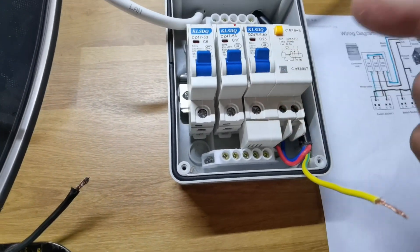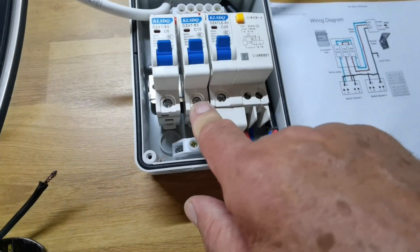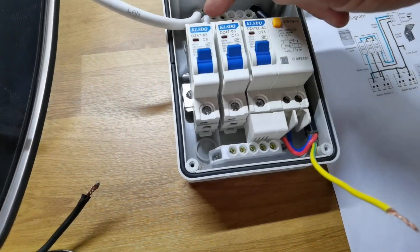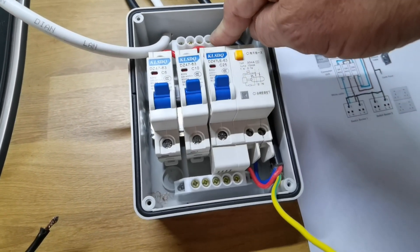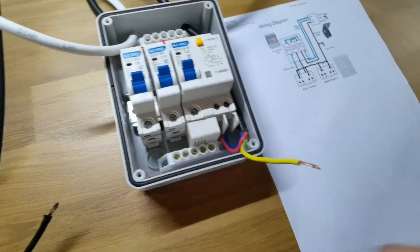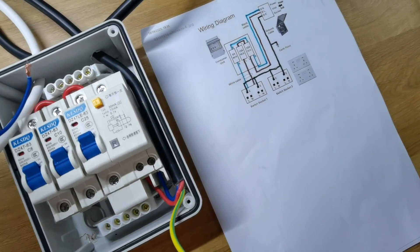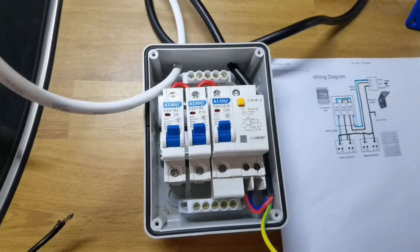Then what you do is take your lives from here to sockets — usually lighting and plug sockets, so 10 amp and 6 amp: lighting and sockets are different things. One of these will be a neutral bar and the other will be an earth bar, like a bus bar where everything connects. So if you've got a plug socket connected to one breaker, put the live to that. We're going to test it so you're not on your own. Put the neutral to the bar at the top, extended long enough, and the earth goes to the earth strap at the bottom.